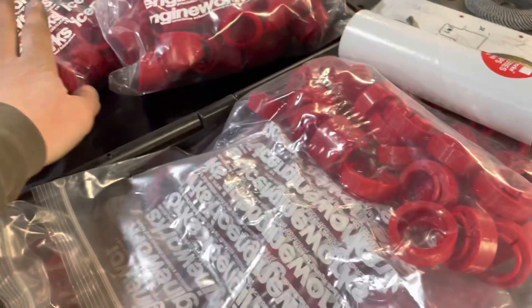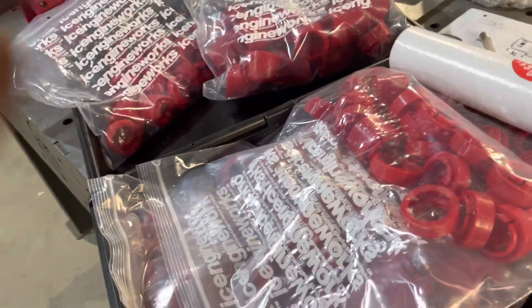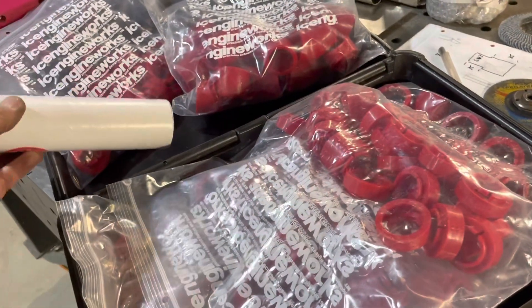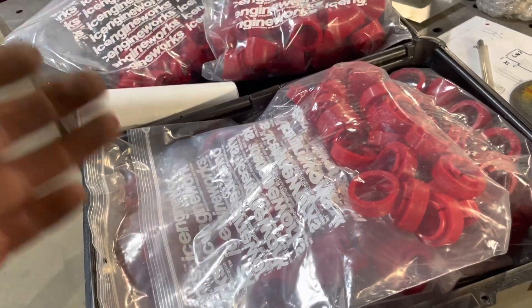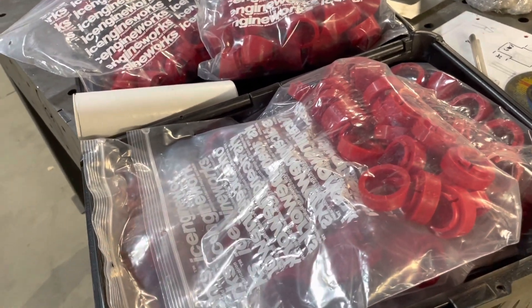Ice Engine Works modelling kit — these are clipped together mock-ups to make our primaries. The primaries are made using the plastic mock-up: cost-effective and really quick. I can make a complete manifold in such a short space of time. Then once I've done that, I take them apart piece by piece and make my primaries in steel.